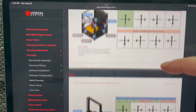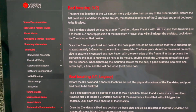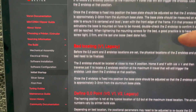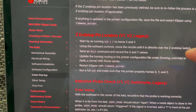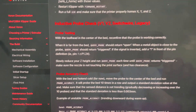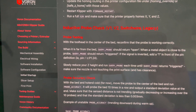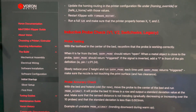It's really important that you follow through with this to get everything located. Then you want to do the Z homing - Z end stops - where you baby step it down until you touch a piece of paper and it's just grabbing it, then you write that to the firmware and it'll save a copy of it.